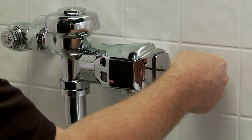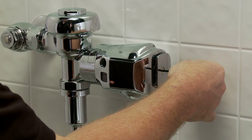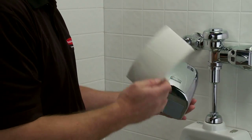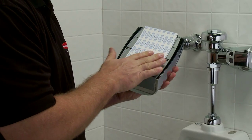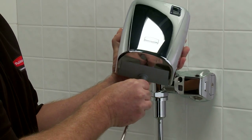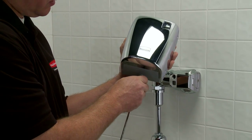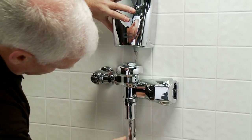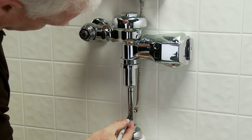After locating all parts and components and disengaging a Rubbermaid AutoFlush unit, you're ready to install the AutoClean Dispenser. Take the backing paper on the foam mounting pad and peel back one side only, then place the backing paper into position on the back of the AutoClean Dispenser. Insert the long side of the stainless tube into the AutoClean Dispenser, making sure to insert the end completely into the fitting, and hand tighten the compression nut. Position the AutoClean Dispenser 2-1/2 inches above the flush valve, as this prevents the dispenser cover from hitting the flush valve cap.